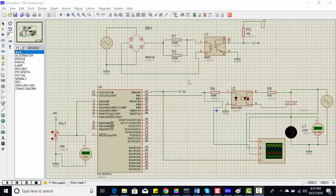What does the soft starter do? It will limit the voltage at the start and then increase the voltage gradually from low voltage to high voltage. In this circuit diagram we are using a lamp and voltmeter as a demonstration, because a single phase induction motor is not available in Proteus. The voltage applied across the lamp will increase gradually. When the voltage is low at the start, the motor will take only low current, and gradually voltage and motor current will increase. So there will be no inrush current and the motor windings will be safe.